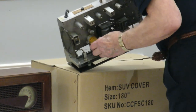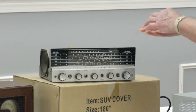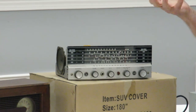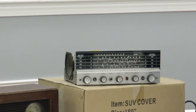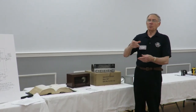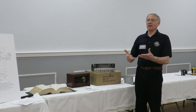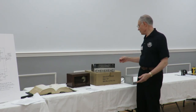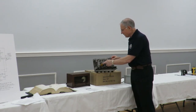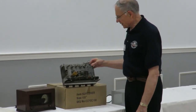On this one, the problem with some of these capacitors is if you decide you're going to put those capacitors underneath the chassis, you don't leave any space. I've worked on some where people jammed all those capacitors under the chassis, and I can't do any more with them. So I end up putting an upright capacitor like this in there, so they have space to work underneath. And by the way, it looks like it's a pretty decent job. This one here, I think I'd probably find a way to either refill this one or put in another metal capacitor in there.